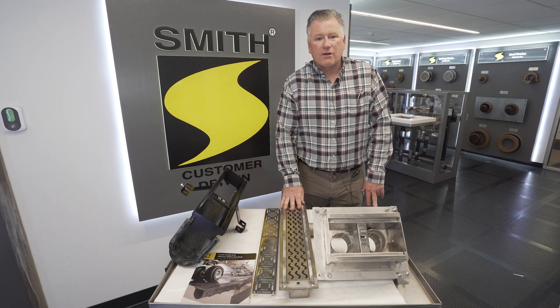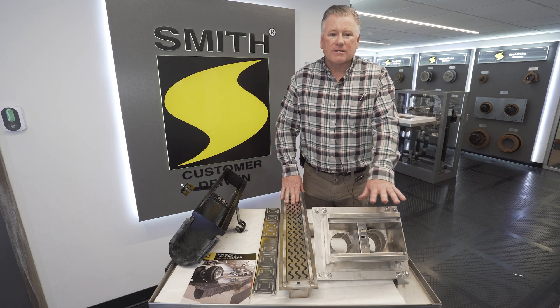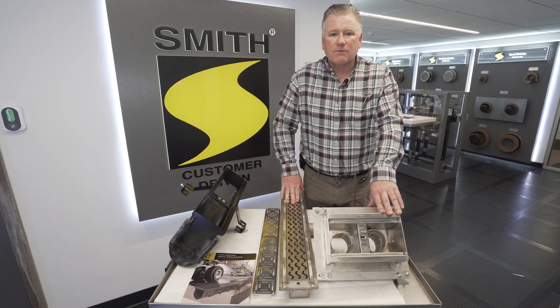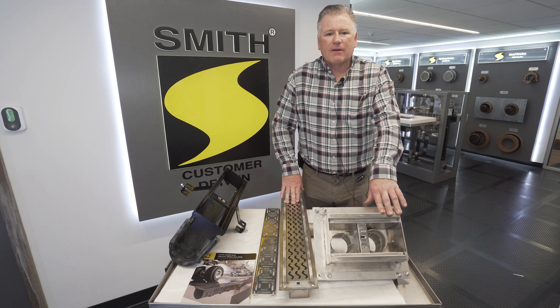This one is one of our shower trench drains that we did a custom side outlet for. And then another box here is a custom box we made for an application combining a roof drain and overflow drain in one stainless steel box. It helps minimize penetrations, and you don't have to float the concrete floor two inches to get an overflow drain into the application.